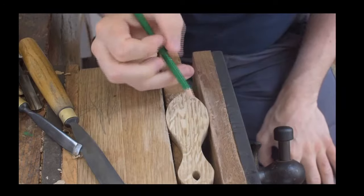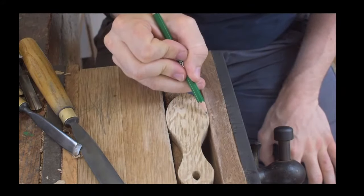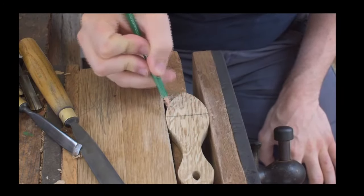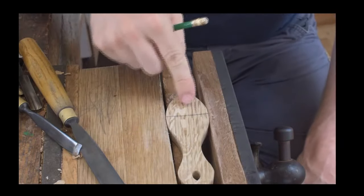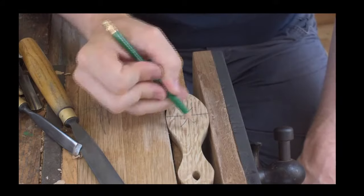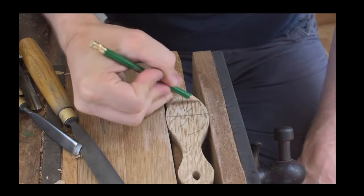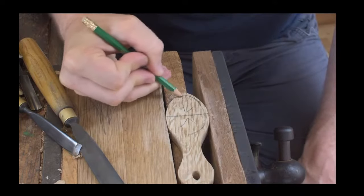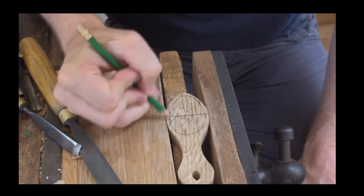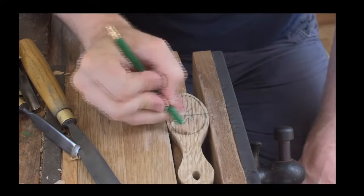When it comes to doing a spoon, the first thing before we start is marking out with a vertical grain. What you do — this is just an easy method — put a line across the center and you're going to carve into that line there, and carve into the line there as well. We mark out an outside line and we work into the middle line but back to our outside line. This is just an easy demonstration of hand carving the bowl of a spoon.